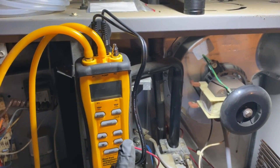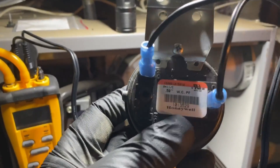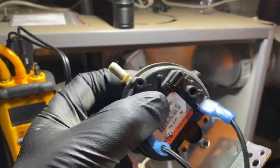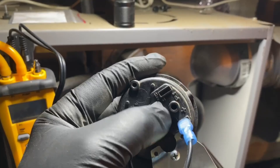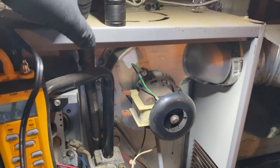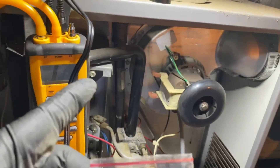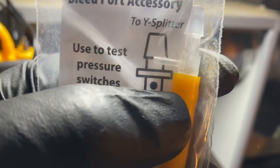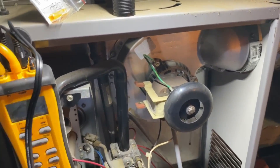The SDMN6 has a pressure switch testing option. First, figure out your minimum inches of water column - this one is 0.59 inches. Also verify if it has a bleeder port; this one does. The bleeder port is basically a pressure relief valve so you don't damage the diaphragm. If your switch doesn't have one, you use the rubber adapter accessory to add a bleeder port to the meter.